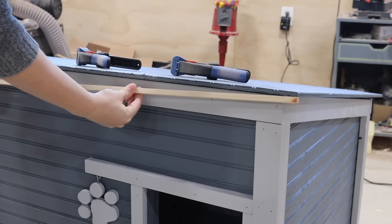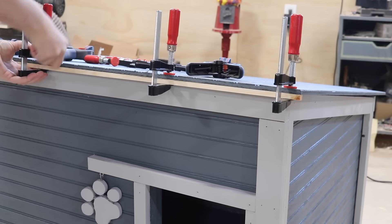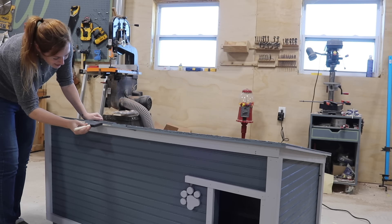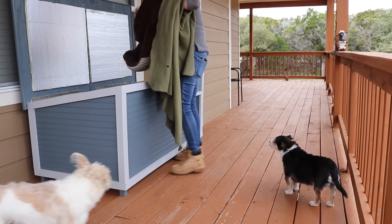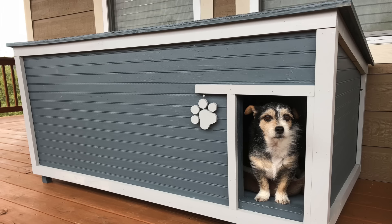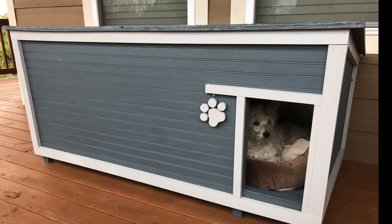At this point I thought I was done, but the roof was really bothering me with how thin it looked compared to everything else. So I ripped some half-inch plywood and added a small strip around the perimeter of the underside of the roof — it just bolsters up the look and I think it makes it better. I placed it so it wouldn't interfere with the trim of the body, laid down a bead of glue, and clamped it until dry. Now the pups have a place they can all three crawl inside to get out of the wind, be together, and still have room to move around. I also have a way to peek in and make sure they aren't staying up late and ordering pizza. A few Instagram followers mentioned their dogs would tear into exposed insulation — mine don't chew things up, but if yours do, I'd recommend using a thin layer of sheeting to hide it. That's it for this one — I'll see you on the next one.